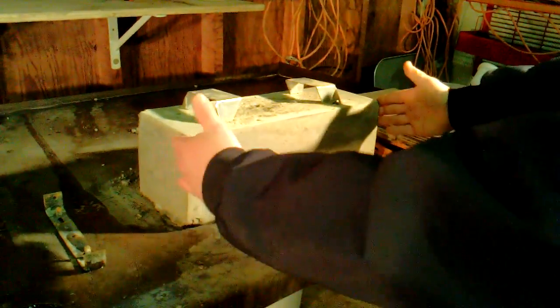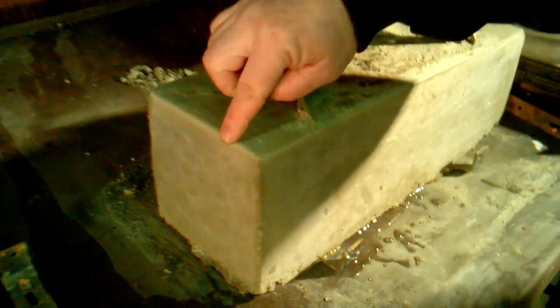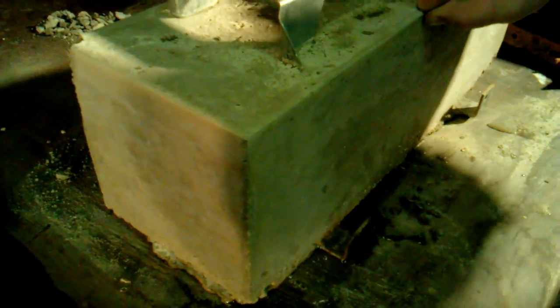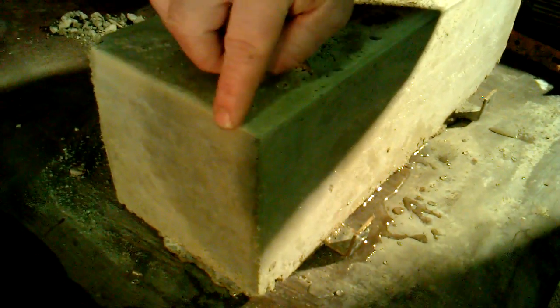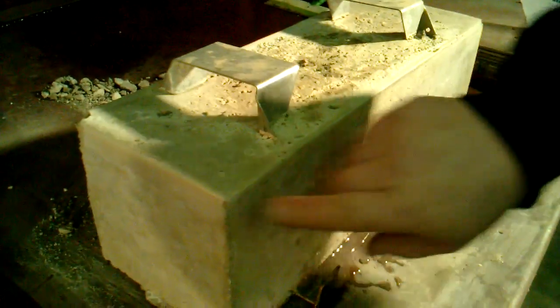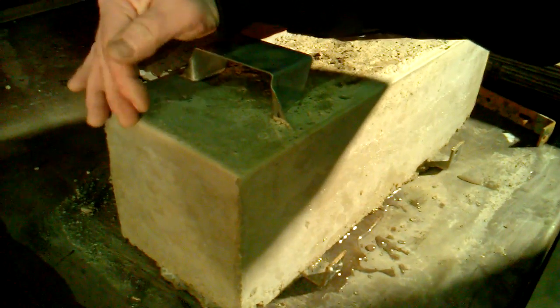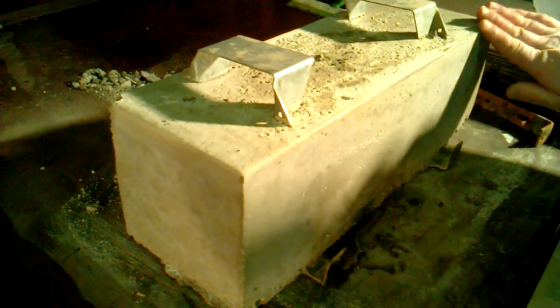What I did here is I just poured a little 8 inch by 16 inch cube of concrete and put some metal in it for handles. One thing I noticed — if you can zoom in — on the edge of this thing, usually this edge breaks off when you strip your forms because it's square. But after I was done pouring, it actually looks like I took a quarter-inch edger and went around the whole top of the forms. The corners came out nice and square, but the hydrophobic coating pushed the water over the top and actually rounded the corner, which I thought was really cool because when you strip your form, usually the top edge peels off and spalls. That's kind of like why they run chamfer — the corners don't break.